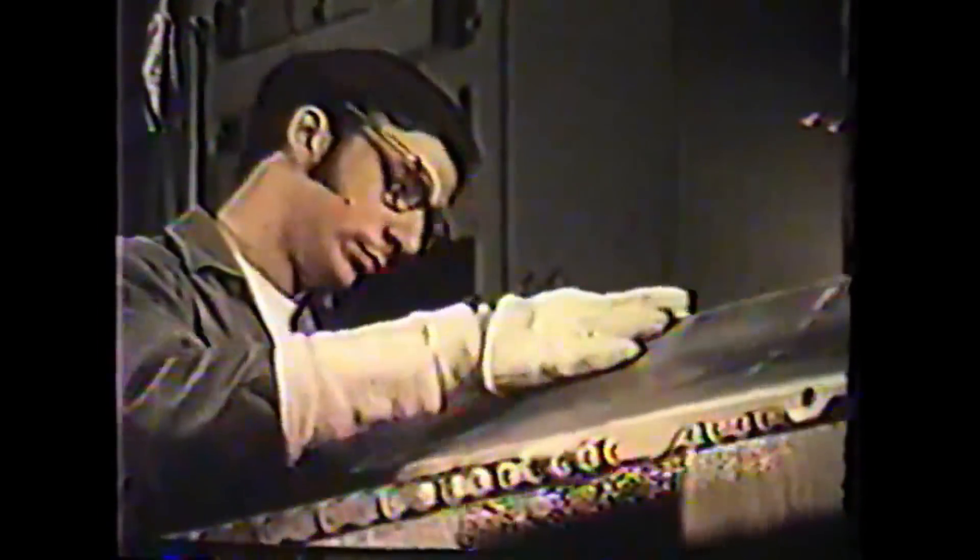Sheet metal is in production. Bumpers begin their lives as sheet steel, then move through a series of forming and trimming operations. Before chrome plating, a careful buffing takes place. It improves durability and is the beginning of a gleaming, satin smooth finish.